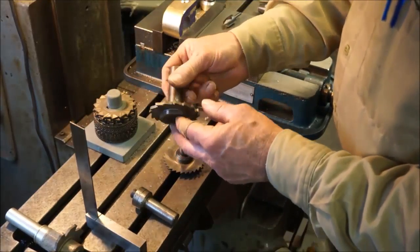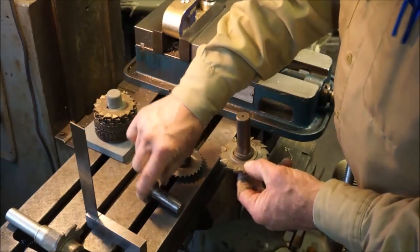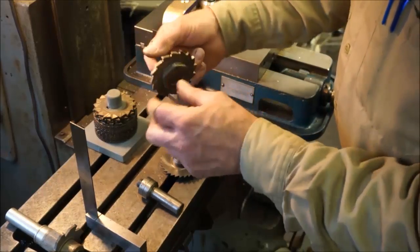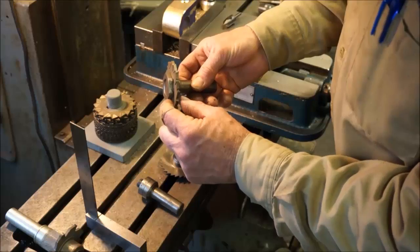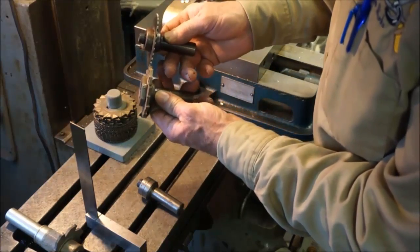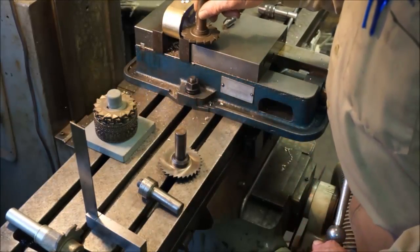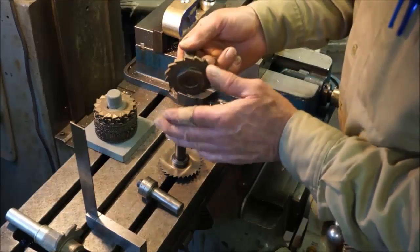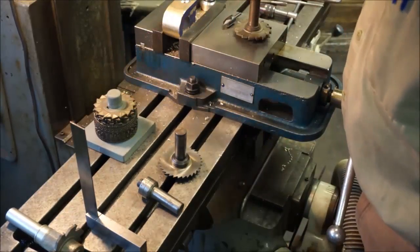Now here's a homemade job, and this is 3/4 inch, just like this one and this one here. And they created a threaded nut, a giant nut here, so that they can tension that. And this right here happens to be a pretty wide cutter for this tool right here, but this nut being real narrow, you can see protrudes out a lot less than there. And this is what I'm thinking I'm going to come in here and cut this because it's shallow, and I've left myself a 1/2 inch here, and I believe that this will clear the mill table jaw as I come by and I cut this. So I'm thinking about using this. I'm going to set that up in a minute.